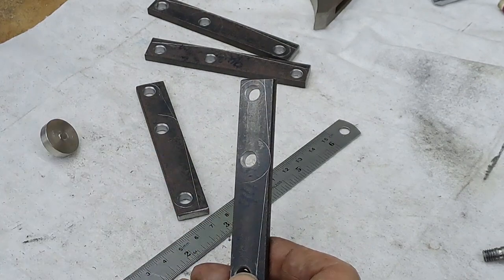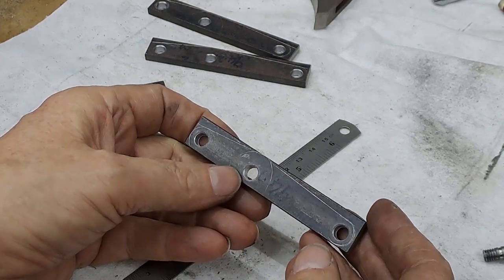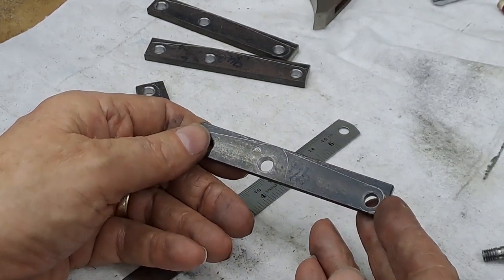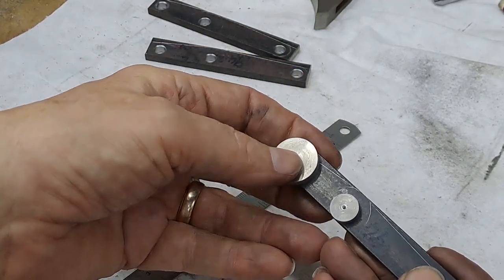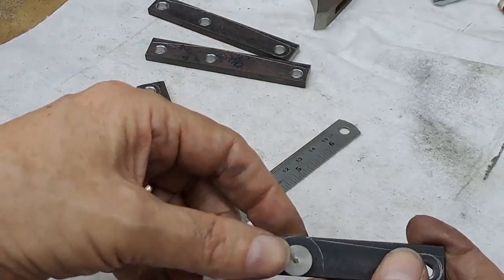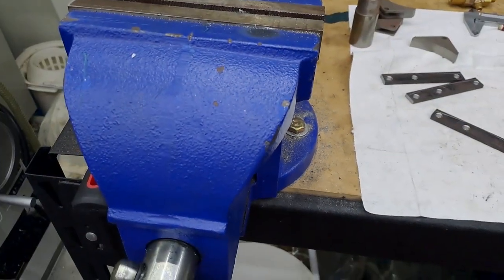Right, now another thought occurred to me. I've got either a lot of hacksawing to cut that off and file it clean, but I thought, well, I'd rather use the milling machine. I know it seems a long way of doing it, but hey, that's me. So it dawned on me that if I reverse those around, put the 6mm in there and the 12mm in there, and rest those on the top of the jaws in the mill vise, I'll just get you over here now. All right, let's move you. Zoom out a bit. There we go, and I'll tip you up.